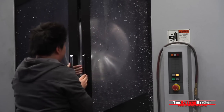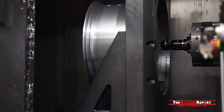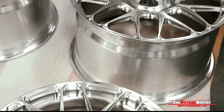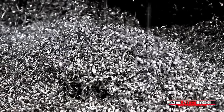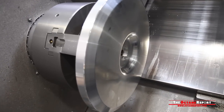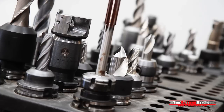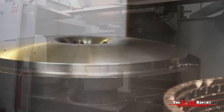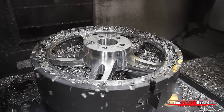Separate computer programs are required for each wheel design, which themselves balance strength, load distribution, looks, and brake clearance. For the multi-piece wheels, even more steps are required to take care of all the pieces. After machining the raw forgings from dumbbell look-alikes to aluminum discs, it's time for even more tooling. CNC machine programs are created for each multi-piece wheel face design, which requires the forging to be flipped and run twice to reach the front and back sides.